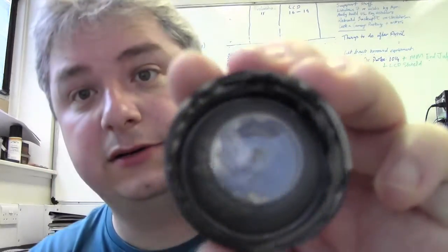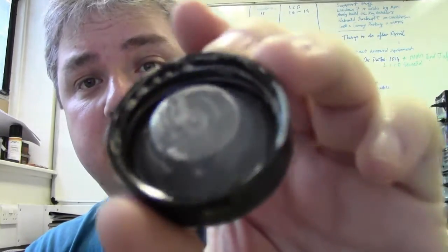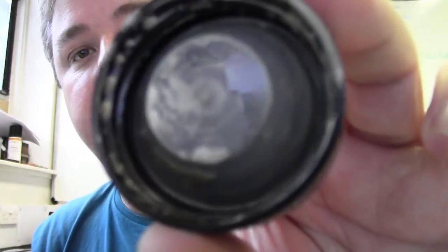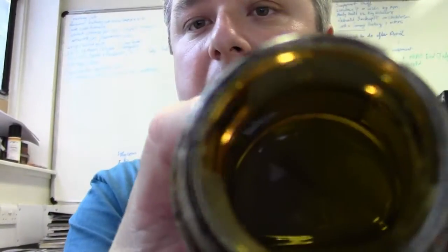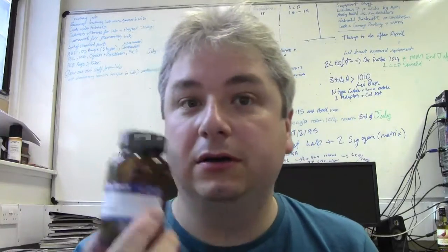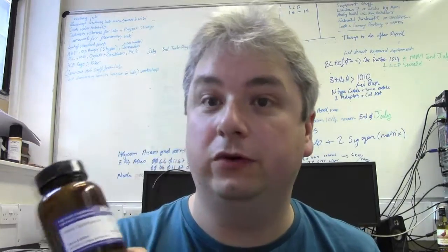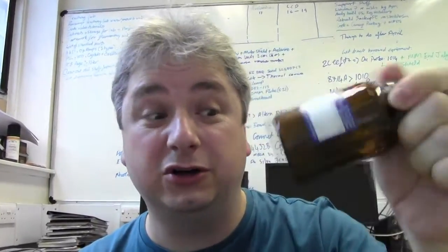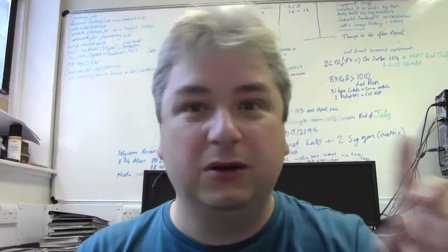You can see it on the lid — it's quite viscous. That stuff is quite thick; it can get thinner or thicker — that's a medium thickness. You can thin it out with acetone or a suitable thinner. If you do use a thinner, do it on a test piece first. The wrong thinner can cause this stuff to harden off quite quickly into a horrible gel. But it is expensive — it is pure silver, sterling silver.